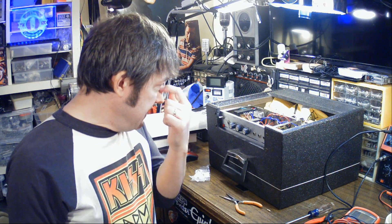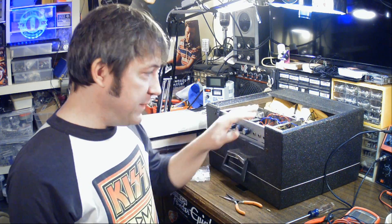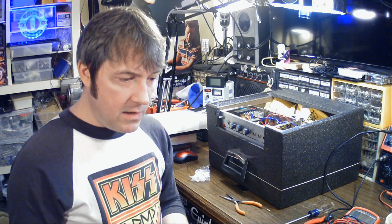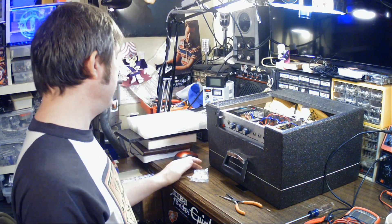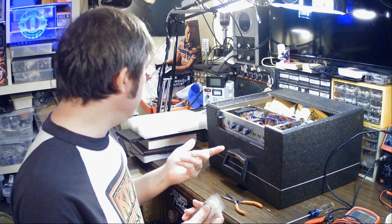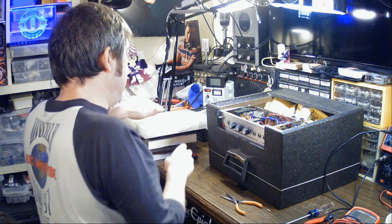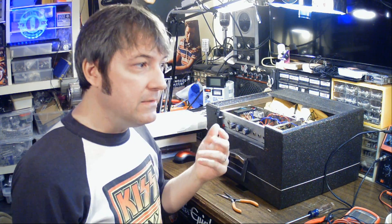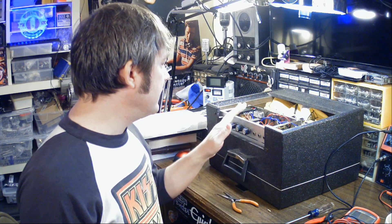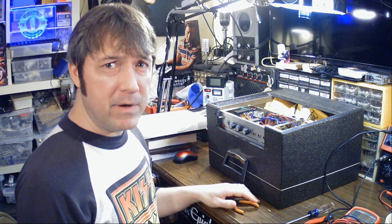I will link this video to the other video in a card, that way anyone who is interested in the specifics of this model will have a little bit more information. Thank you to that commenter who brought that to my attention — without you, I would have probably just left it as is and sent it back. It did sound really great, honestly, with just that one meg grid leak resistor on that first stage. It's really a testament to the forgiveness of tube gear that you can get something that far off, and it not only still operates but still sounds great. It should actually increase the volume somewhat — it's probably not going to change the tone all that much, but it should increase the volume.